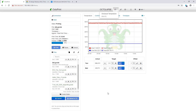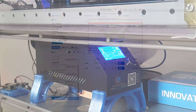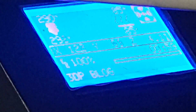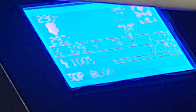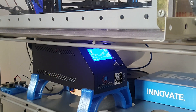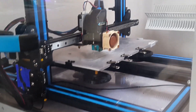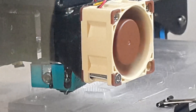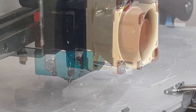As you see, the temperature of the hot end is oscillating a lot. I have a 40-watt heater and at this temperature it is not able to maintain it steady, so it's oscillating something like 5 degrees. The other issue I discovered is my hot end was leaking — polycarbonate leaking between the heat break and the nozzle. I can only imagine what extrusion pressure is needed to continue printing in these conditions.